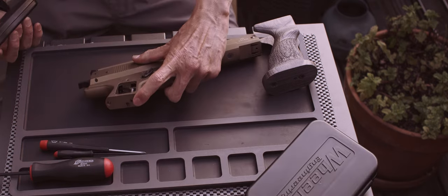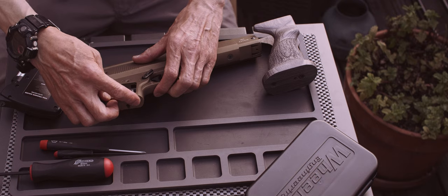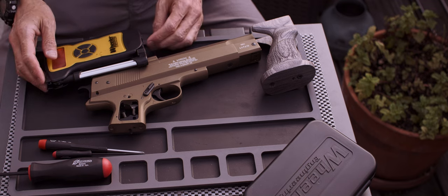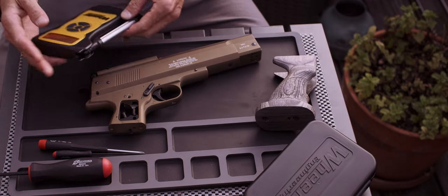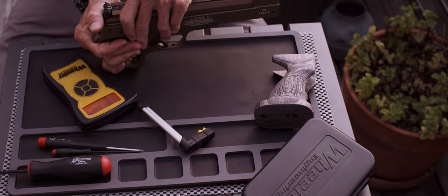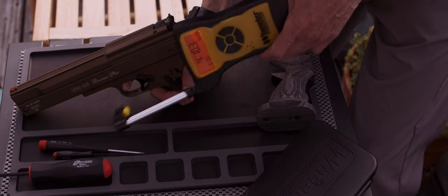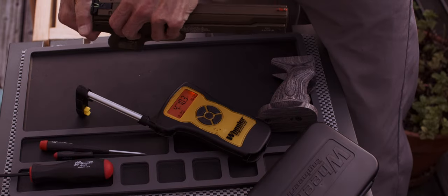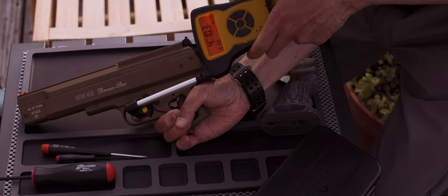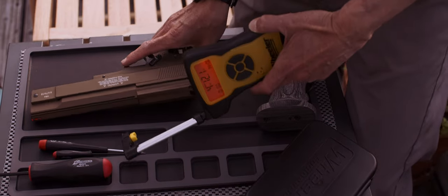Turn this screw in will make trigger pull heavier. Back out will make trigger pull lighter. So it's 7:40. I have only 20 more minutes. The sun goes down at around 8. Let's measure the current trigger pull weight. Four pound 12 ounce. Okay.